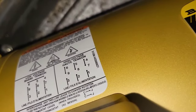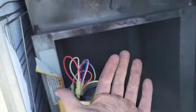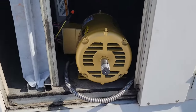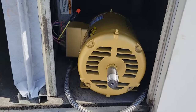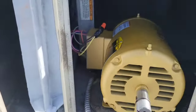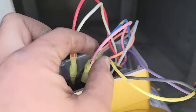So what we're going to do now is lay it down and see what direction it spins. We want it — you see the arrow on there — we want it to spin with it, because this thing is going to be facing out this way. There's going to be a pulley on it and it's going to be pulling. You want it to spin in the same direction that you want your airflow going into the unit and down into the store. So now we're just going to test it and see what way it runs. You can see that's the opposite way in which I want it to go. So we're just going to take two random ones and switch them — I'm going to take this red and white and switch it with this purple and blue.